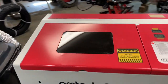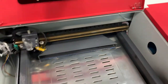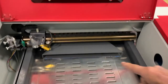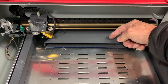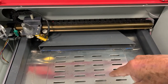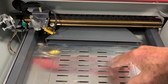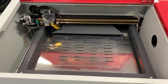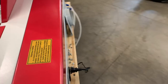There are a couple of things I've seen in YouTube videos that are problems. One of them is the exhaust fan. The exhaust portion extends into the cabinet, and you lose probably three quarters of an inch of your actual working area. It seems to still draft okay, but not as good as I was thinking it should. So I got to doing some checking on the back of it.